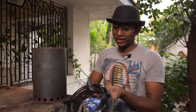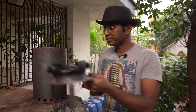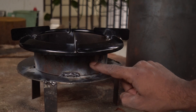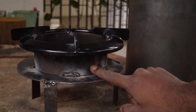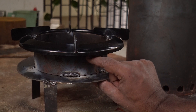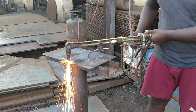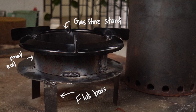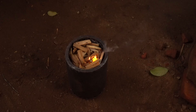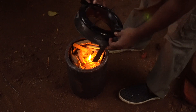This part here was not made before — this is an additional thing that I've made. This top piece will concentrate all of the flames in one spot. The centerpiece shown here is made by rolling sheet metal into a tube on hydraulic machines, just the way the body of the stove was made. The diameter of this tube is smaller than the inner tube of the stove. Therefore, it is welded to a metal ring, which was cut at the industrial yard as well. It has a few flat bars welded at the edges to place the whole unit safely on top of the stove without slipping. For the container stand, a circular gas stove stand is welded on top. The stove was filled up with wood and once the fire started, the stand was placed on top.